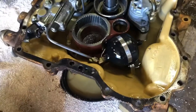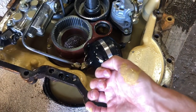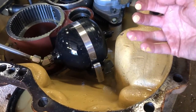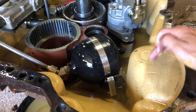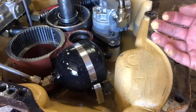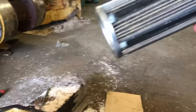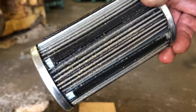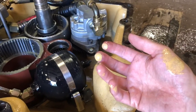Last thing I want to show you — this winch doesn't look like it's been totally opened up yet. If you look at my hand, it's yellow. The paint they use from the factory wasn't the right kind of paint — it looks like it was a water-based paint and it's getting eaten away by the oil. So when we rebuild this, it's going to get fully cleaned and get rid of most or all of that yellow that's already coming off. You'll see a problem in the strainer: that paint as it peels off has a habit of getting clogged in the strainer and it'll cut off your oil flow and cause a bunch of issues. We know about it, but the fix is to take it all apart and get it out of there — it's a bear.